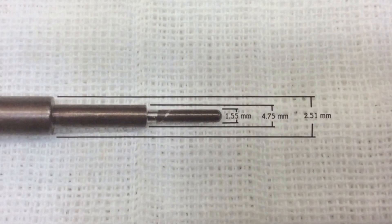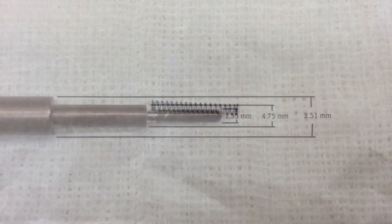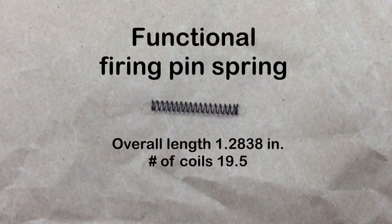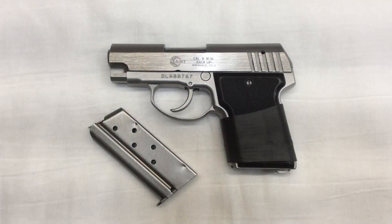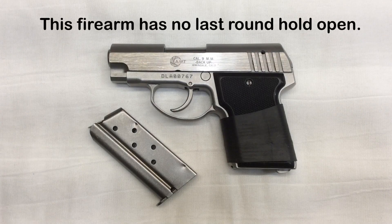After the experiences I had with this pistol, there are a couple pieces of advice I feel I can give. The first is: I would try not to dry fire this firearm. Every video I watched, people are just constantly dry firing this gun. No matter if you think dry firing makes your firing pin weaker or not, do you really want to take a chance when a replacement part might not be available? I would even try to count your rounds at the range, because the slide doesn't hold back, so it's extremely easy to dry fire this at the end of every magazine.